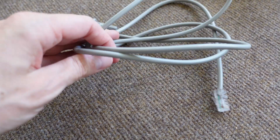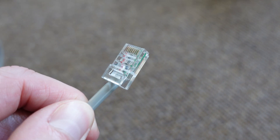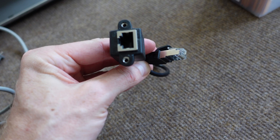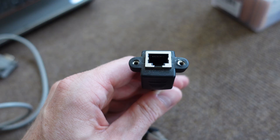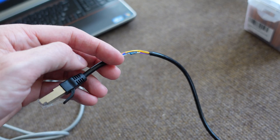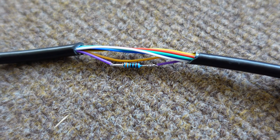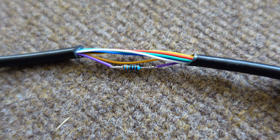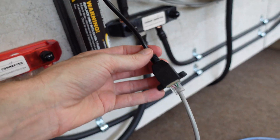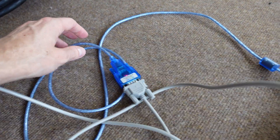I really didn't want to cut this cable to apply the resistor. It's just an RJ45 on the end, which is easy enough to re-crimp, but I didn't want to cut it. So I got a one-foot Ethernet extension cable — a straight-through, eight-pin cable made for panel-mounting a female RJ45 connector. I cut some insulation off, and pin two is the purple wire, so I simply cut the purple wire and soldered the resistor in series. Now the cable runs from the inverter, through the one-foot extension, then the MPP Solar cable, then the USB-to-serial cable, then to my laptop.